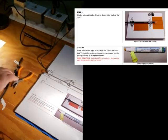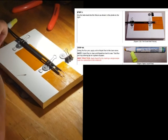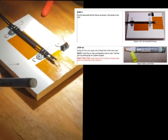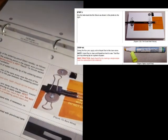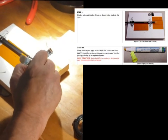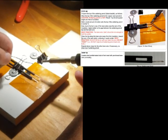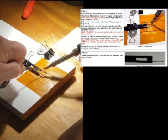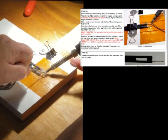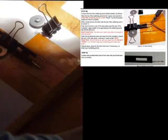Then we clip it into the fixture and take a little bit of flux — we've got flux in a pen — and rub some of that on both pieces. Then we take the soldering iron and a little bit of solder, clean the iron first, and prime it with a little bit of solder to get it wet. The solder conducts the heat, and we run it along to tin the piece of copper.